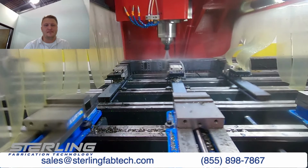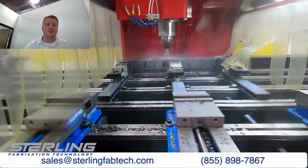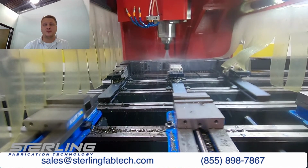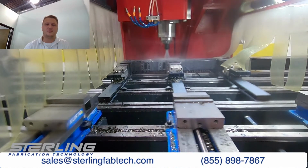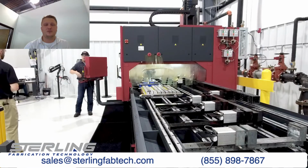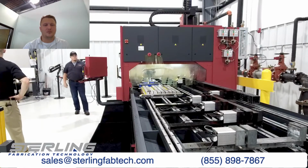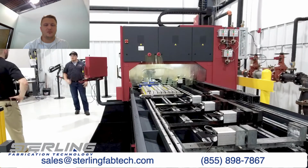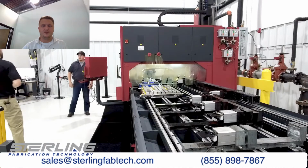Understandable. The milling that I'm going to be doing, because I am doing a contour ramp, I'm not taking a full depth of cut. I'm not putting a lot of side force on the part itself, which is where the pneumatic vise, as compared to the Kurt vise, kind of lacks a little bit in performance. Putting a lot of side load, that's not what that vise is meant for. That vise is meant to hold that part while you're putting your down pressure on the part. But because of the contour ramp that I'm doing with this solid end mill, I'm not doing a lot of side load. I'm just going to be ramping down into the part. Those vices work perfectly for what I'm going to be doing.